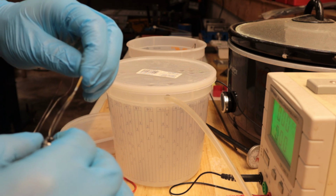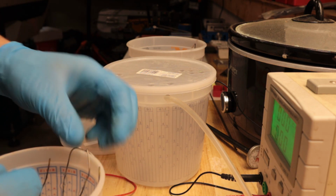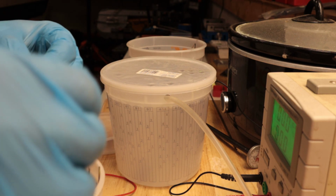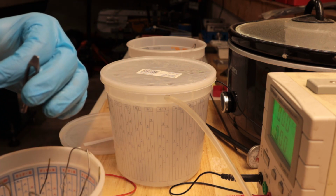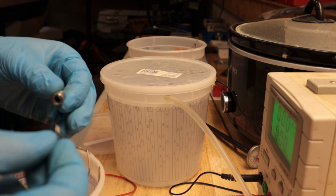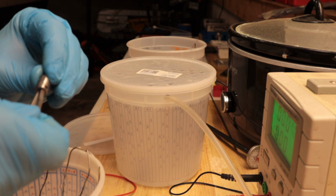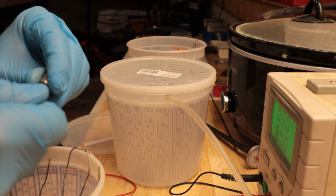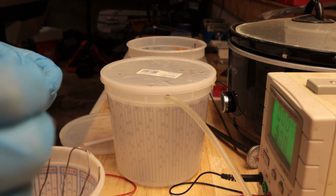So one of these is a color shifting one, I don't know, that's just what I'm calling it. The way it works is we're going to start at bronze, which when this is etched, the colors are all different depending on the surface treatment of the titanium. But essentially bronze here is going to be around 12 volts, and we're going to go from 12 volts all the way up to like 88 volts, where I think we can get some pretty cool results.